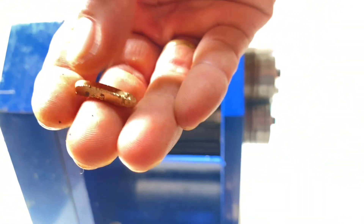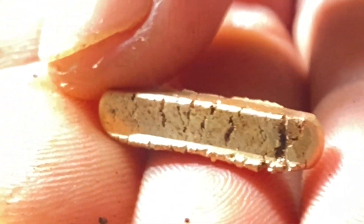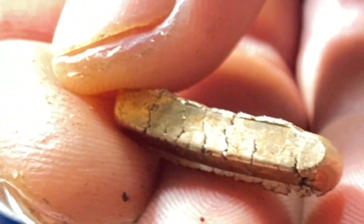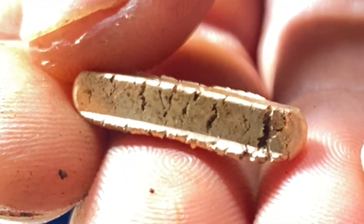After a few times in a rolling mill, it's already broken. I did my research and I've read that this is caused by other metals like lead, tin, or whatever contaminants are present in this gold. That is why it's not malleable anymore.